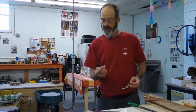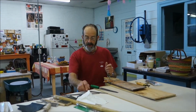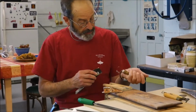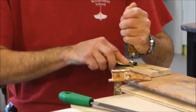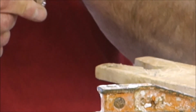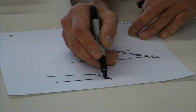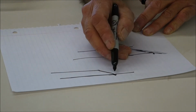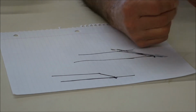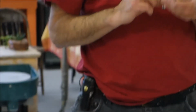If you have, like this little round file we call a rat tail file, I could clean up that burr, but actually just a piece of this, wrap it around the sharpened side. That's enough to, well, it's not softening. Again, exaggerating, of course, but it's changing this by taking that off, by dressing this flat. Now you're bringing it to a sharp point. And also those burrs can get raggedy enough that they can cut you, it'll be dangerous. So it's good to think in terms of sharpening and then knocking down the underside of it.